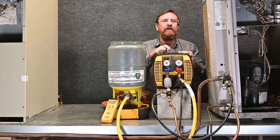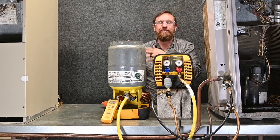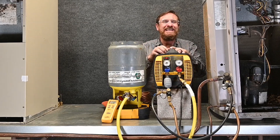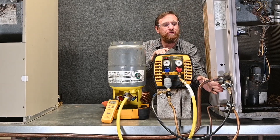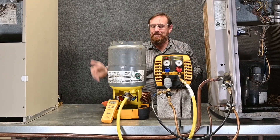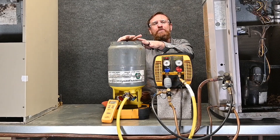I have more of those big hoses, but I save them for vacuum. I never want to use the same hose for recovery as for vacuum because the oil will get impregnated into that hose and make vacuum take a lot longer. Thick hoses, no Schrader ports, putting a T and doing away with the manifold gauge set made a huge difference, as did the big hose and inverting the tank — but we can still speed it up more.